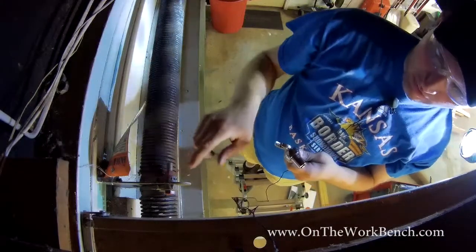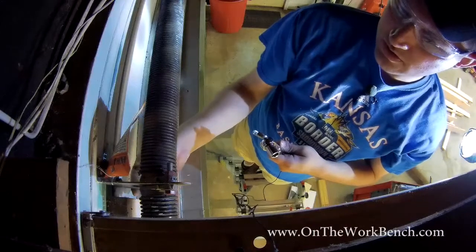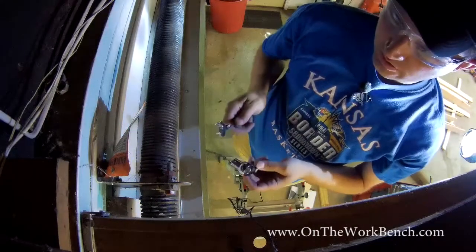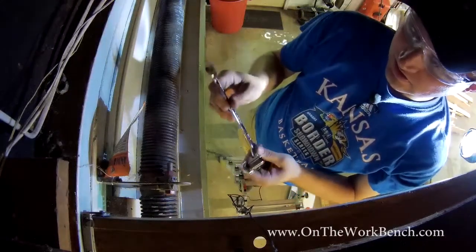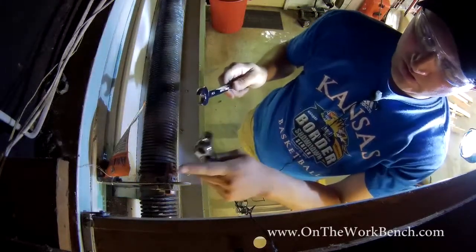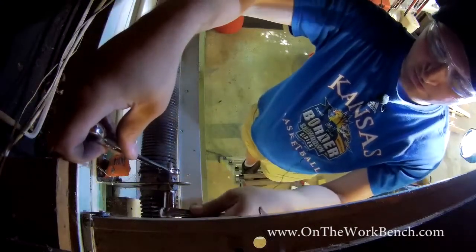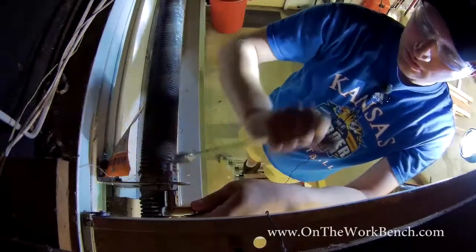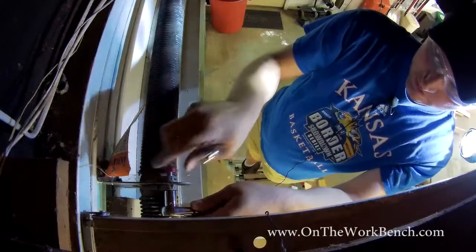So now back in the middle, I've got a bolt here, another bolt back here that's actually holding the springs to the center support brace. So I've got, for my case, these are 9/16 bolts. So I've got a 9/16 socket, a 9/16 wrench. If you're going to put a socket on the backside here, you'll need a deep one. Again, my case may be different than your case for what you need to do to be able to loosen up these bolts. That comes right off like that.